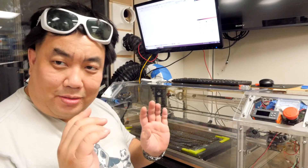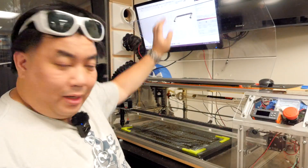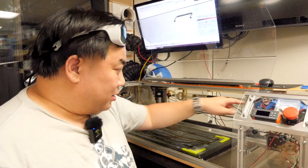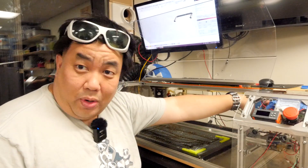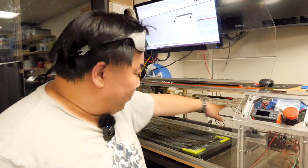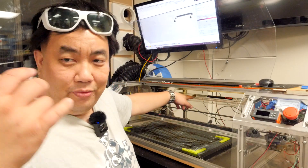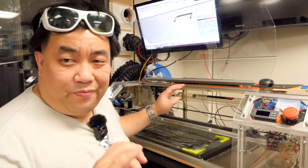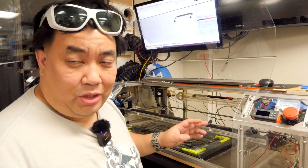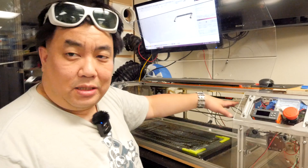So before we get started, let's talk about how this laser works. In here, in the back, is the CO2 laser tube. When the computer tells the laser to fire, the high voltage power supply — which is this white box in here — sends a 24,000-ish volt pulse through it to ionize the nitrogen and CO2 gas inside, and then sends about a lower 15,000 to 18,000 volt electric current through the tube after the gas has been ionized.